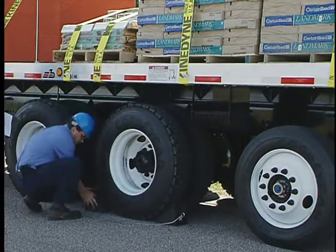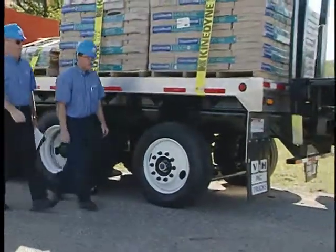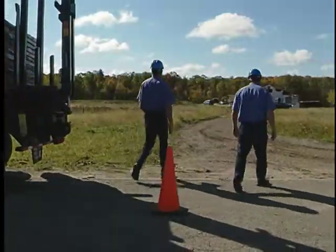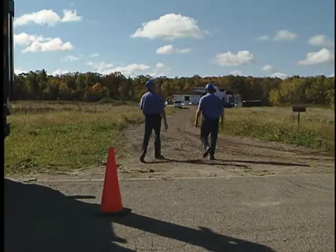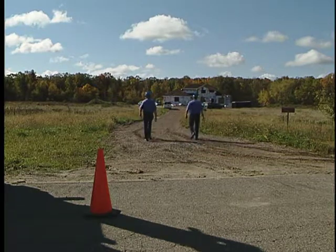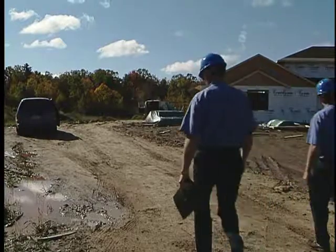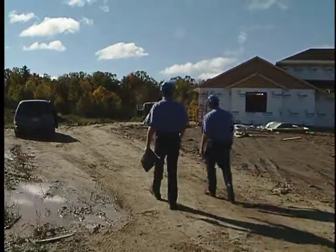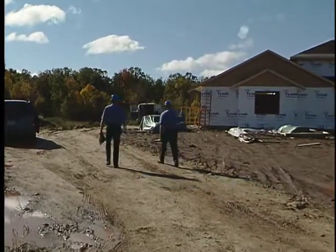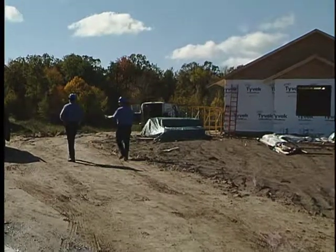Your pre-delivery job site inspection form must be completed before the delivery vehicle enters the job site. During the inspection, you should also inspect the path that will be traveled to the setup position. Both driver and helper should make this inspection together. Know any hazards, obstructions, and challenging road conditions. Keep a heads up for permanent or temporary power lines. Be certain the sky is clear of any obstacles for unloading or leaving the site.